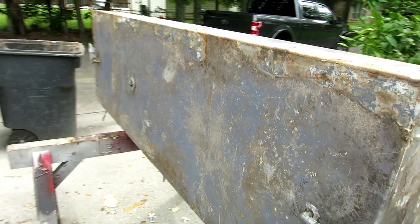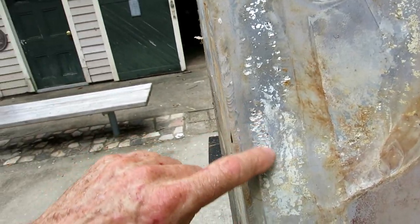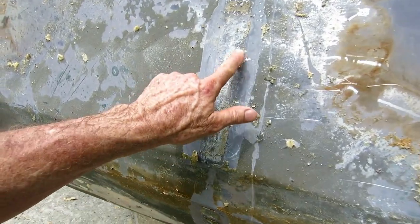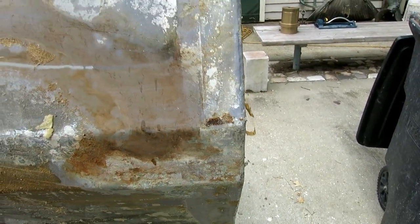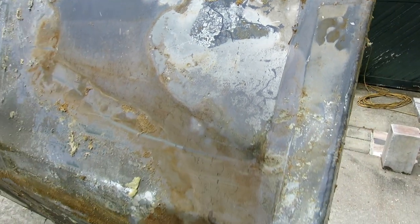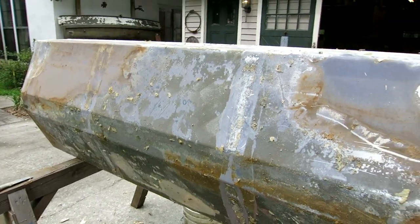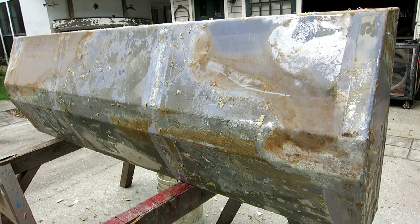It's not leaking because it was more than half full of fuel. It's got a little bit of corrosion — most of it looks like brand new, here's a little bit of pitting, and down on this end where I pried on it with a steel pry bar, it hardly has any damage, just a little bit of dent. I'm going to call in David Luke — he's the aluminum corrosion specialist — and see what he thinks. But I think a little coat of epoxy paint, maybe a layer of fiberglass cloth bedded in epoxy, and this thing should be good for another 35 years.